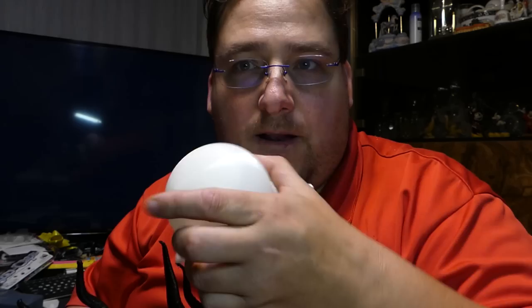I was able to squeeze 162 millimeters out of it, so I usually limit to 160. And then 151, 152 for the Y, so I just leave it at 150. But the Z height, you can go to 225, which is nice because you can print nose cones with it. I can't print these new nose cones on the Maker Select or the Wanhao. This doesn't have enough Z height.